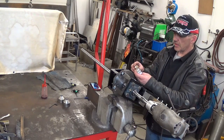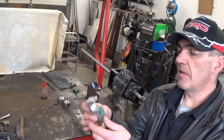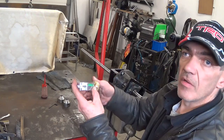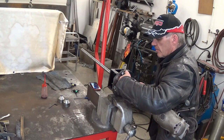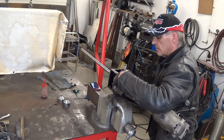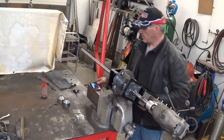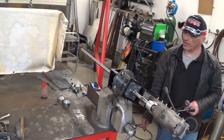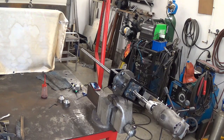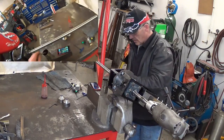What I've designed to go with this is a small setting tool. It's essentially a clamp that will go around the bar, and the quarter-twenty screw in here will push your tool bit out fifty thousandths per turn. So we'll give it a little bit of a dance over, just touching that. We'll give it probably a quarter of a turn. Tighten down our tool bit, and hopefully this works. You're seeing it for the first time with me — put some glasses on and give it a try. Grab some cutting fluid while we're at it, and let's see what happens.